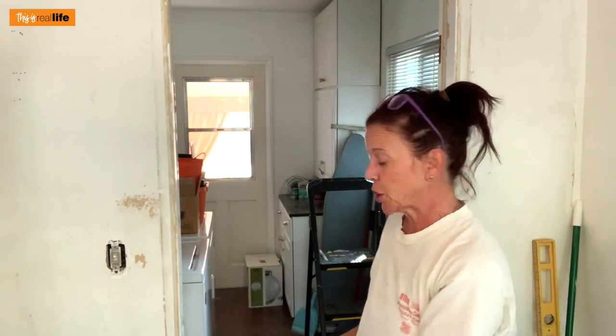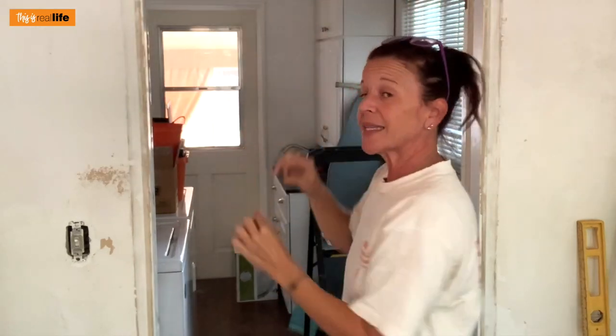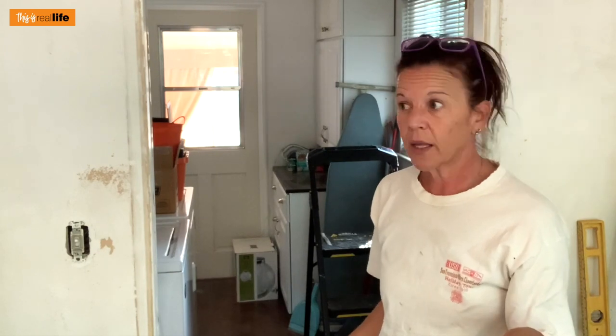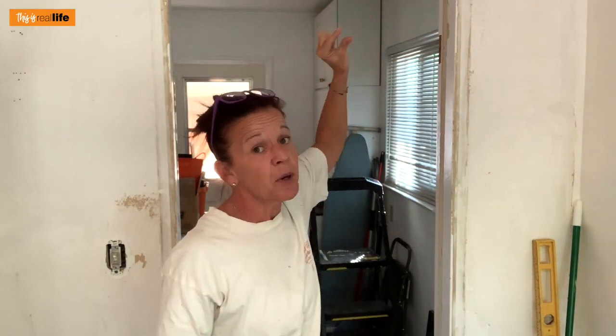And as far as the height is concerned, you're gonna have a bigger gap at the bottom because the way you have to hang your door is up above. So imagine your door fits perfectly from inside to floor, but now you've got to take your door and mount it above. That's gonna leave you a gap at the bottom, which doesn't bother me at all. It's not like I'm trying to eliminate airflow or anything like that. I don't give a shit if my gap at the bottom is 1 inch instead of a half an inch or whatever. Be aware of your door and where you need to hang it. Because I am recycling a door, that does not give me a lot of play at all. My bar has to be mounted very precisely to give just enough, because I don't want to lift my door so high that I have like a 6 inch gap from the floor to the bottom of the door. So I've got to be very meticulous in how I hang my door.